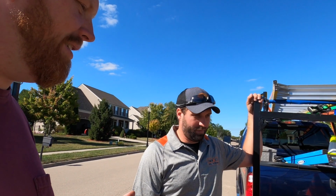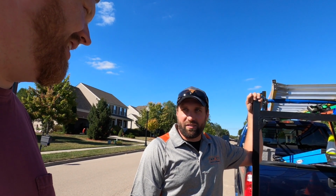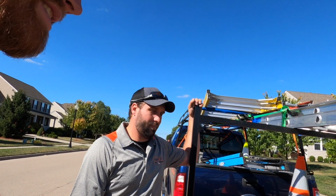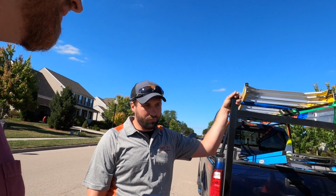And would cold water even clean them out at the end of the day? You'd be using a lot of cleaner degreasers and stuff to get it out. So that's the reason I have a hot water unit mainly, is we're pushing 190-degree water back there to clean out the inside of the bins through those turbo nozzles. And so that's going to sanitize it at that point. That's going to kill anything. And then obviously, do you put anything to help sanitize on top of that?